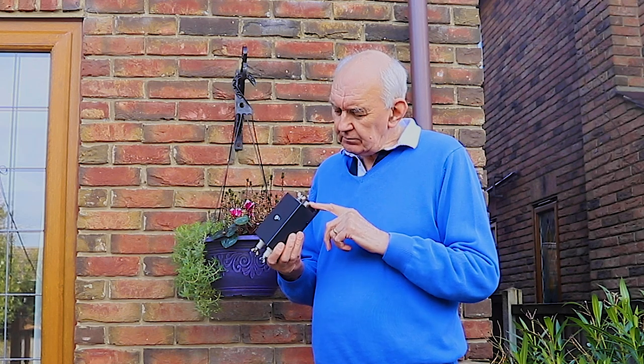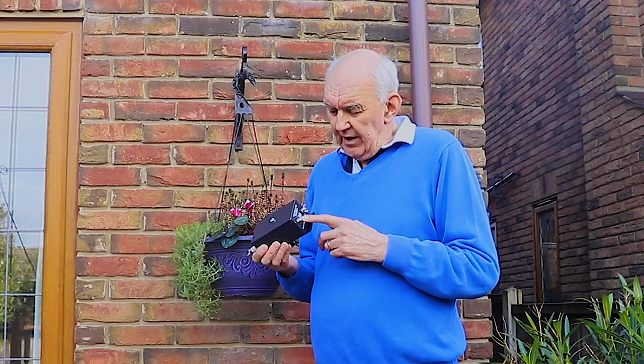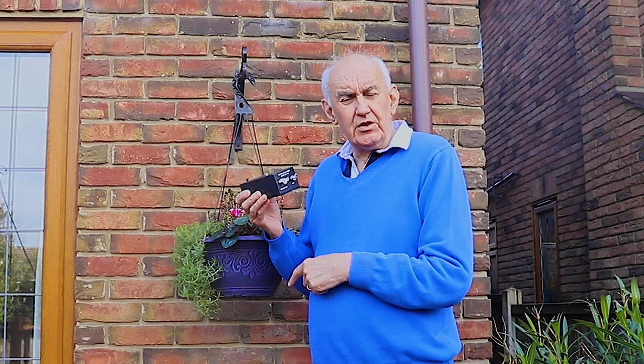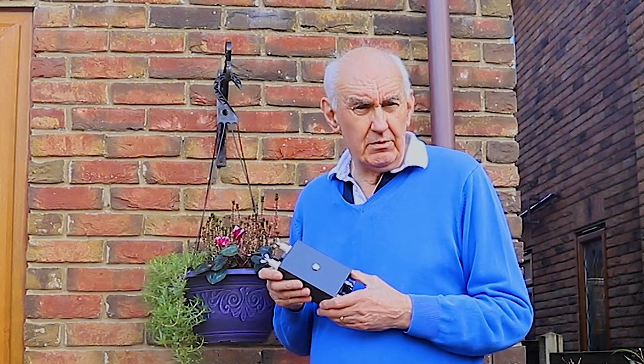On the other end, coax cable goes into an ATU — an antenna tuning unit, or antenna matching unit for those that are pedantic. There will be VSWR on that cable and it could be quite high, but you only need a short length of coax going from the balun to your internal antenna tuner. So any VSWR on that cable is going to be insignificant in terms of losses, provided your antenna tuner can match the impedance it sees.